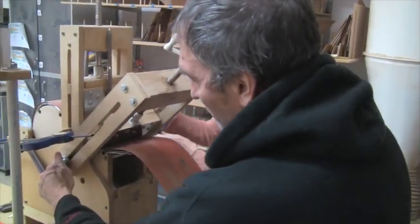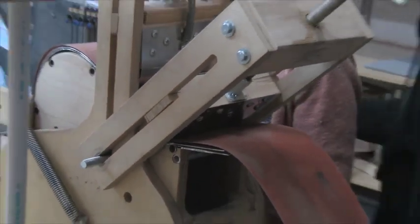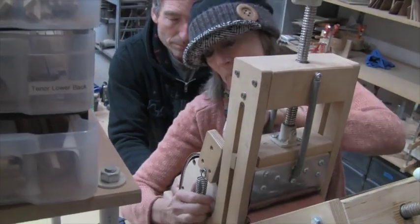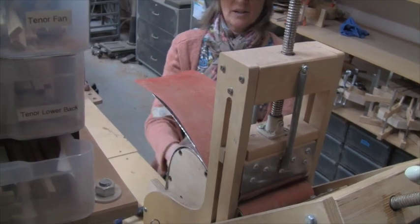We're back and it's time to take the side out of the bender. Before we do that I just want to disclaim that I would never wear this scarf in the shop because it's very dangerous — it could get caught in a piece of equipment. But we're not going to be using any motorized equipment and we're on our way somewhere, so that's what that's about. Now we're going to remove this. First thing I do is take the clamps off that are pulling in the tail piece, and then Gordon is going to come around and hold down the tail so that the spring steel doesn't pop up and crack the sides — holding this lower piece down so it doesn't pull up on the side.